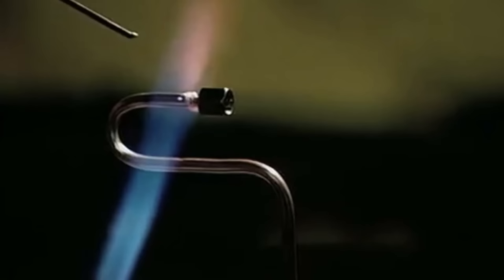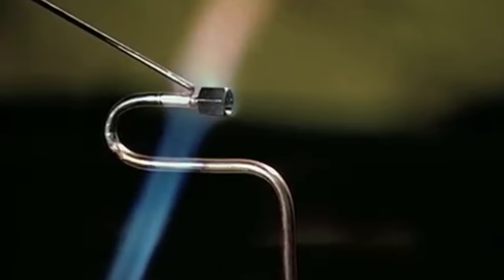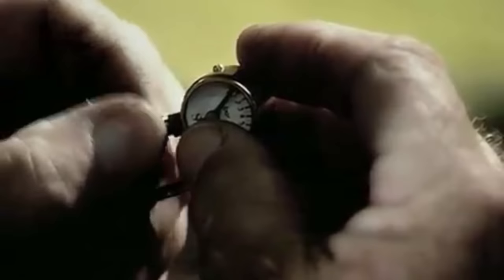To withstand the rather high temperatures the steam can reach, around 300 degrees centigrade when superheated, silver solder is used. Soft soldering pipes and pipe nipples is quite unsuitable. The steam pressure has to be checked continuously, for which one or more manometers are used.